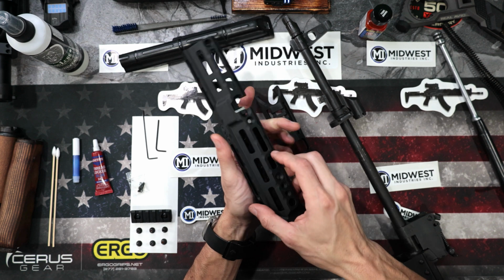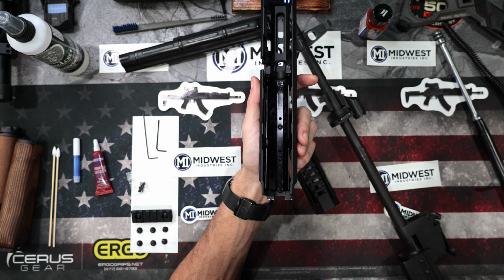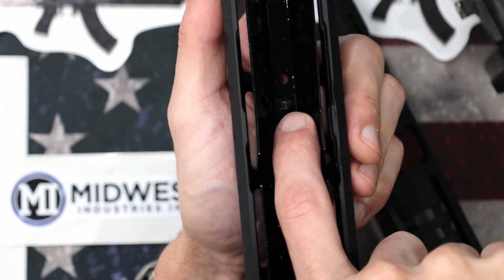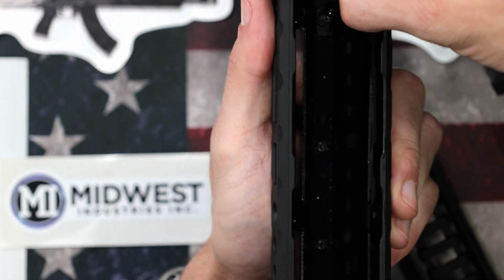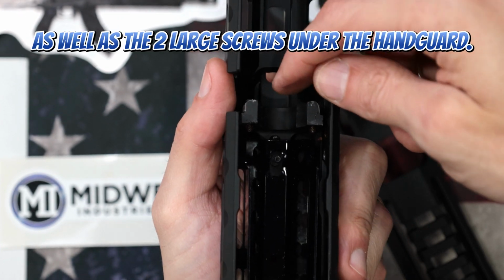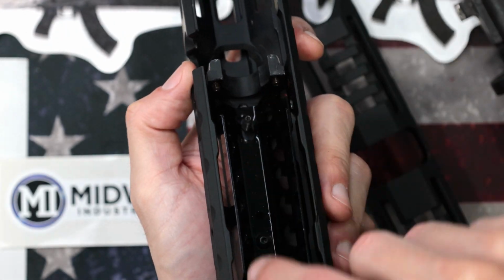So then you have your Allen keys and the 6 screws right there. Okay, so you do have 2 screws right in here. Okay, right in here you have these 2 screws. These screws lock down the U ring here. Okay, this ring right here. And this also goes into the barrel. So I'm going to remove these 2 set screws.